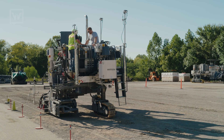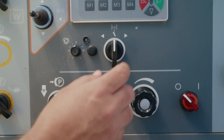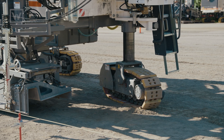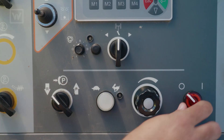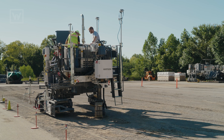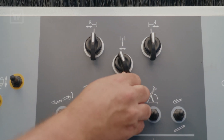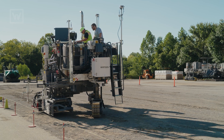All right, Donny. To get this rear track closer to our mold, we need to point the back of the track in the direction we want the leg to shift. Go ahead and do that by using your rear steering switch. Now, as we go in reverse, we'll slide the rear leg over using this switch here. I'll start going — a little bit faster. Good. Just over to the left, correct? That's right. Donny, slide it over until you feel comfortable that you're not going to be able to steer the track manually into the mold.